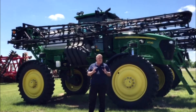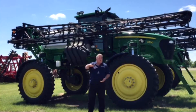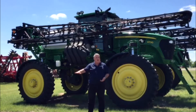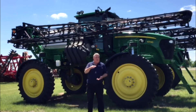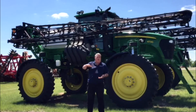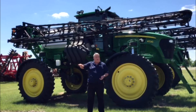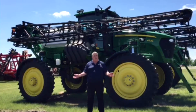What hybrid mode does is basically combine soil and crop mode together. So when you are running in crop mode and you hit a low spot or a drowned out spot, most systems will cause that boom to want to dive. By the time it recovers, the boom is going through good crop. What hybrid mode does is keep a virtual picture of what it last saw, so that boom is just going to float along with you until it picks that crop line back up again. It gives you a better pattern of spray, you continue your speed, and it just makes operating the system so much easier.